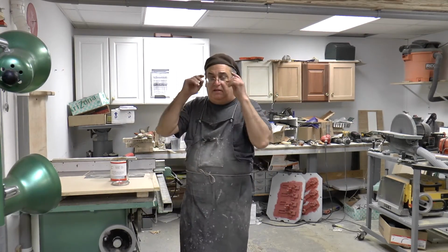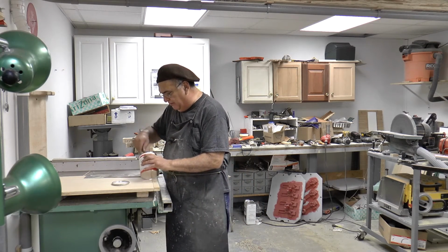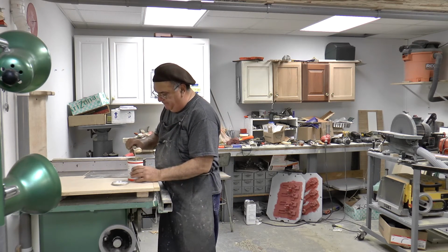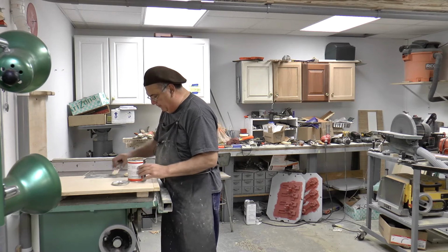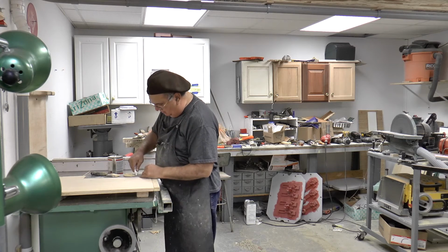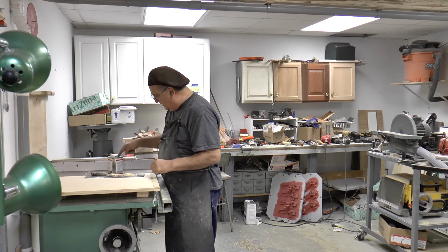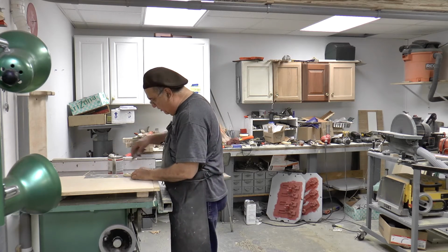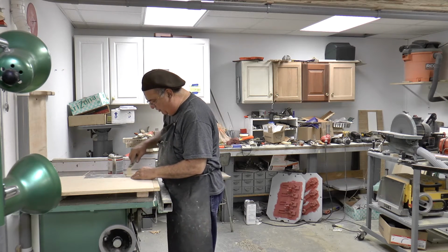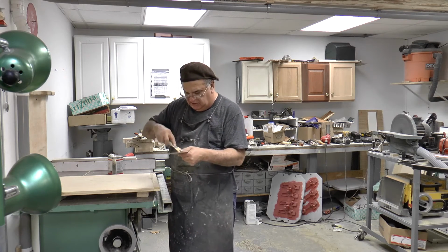Okay, I decided to show you how this Bondo stuff works. And if you were here and able to smell it, you'd say, that smells just like Bondo. So you take a glob of it out, put it on here. That should be enough, hopefully, to do both sides. And an equal amount of hardener. If you look at the size of the hardener to compare it to that, that's how much you put out, kind of like a ratio. And I never could figure this out. You got a little tiny golf ball of stuff there, and a little tiny pea size of the hardener.